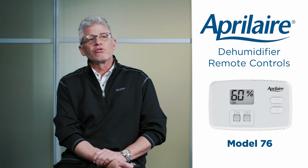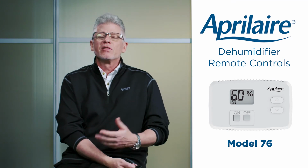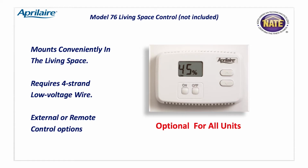We have remote control capability with our Model 76. This is a neat little piece. The Model 76 is really popular. Remember, if you hook a dehumidifier up to a thermostat, you're now measuring the RH at the thermostat, not at the dehumidifier. Now, in a crawl space or an attic application, that may not be the best option.